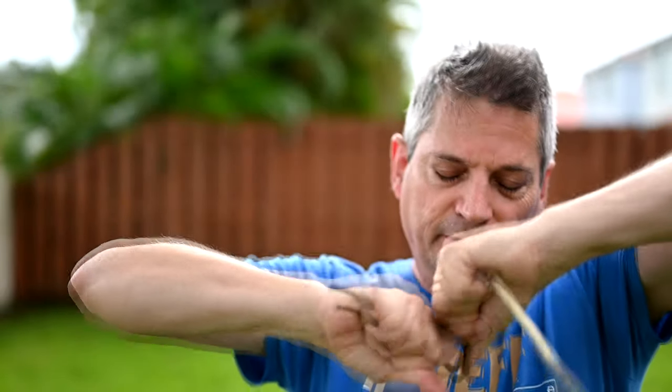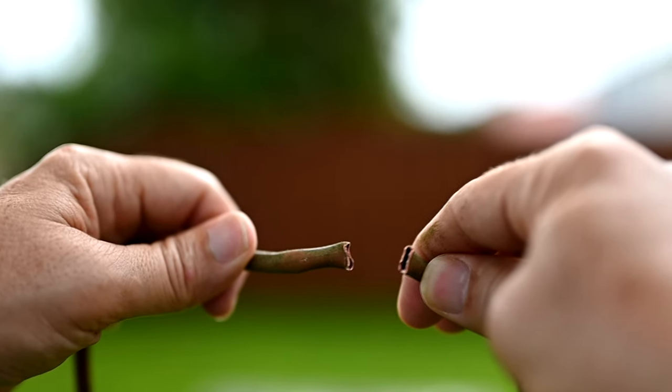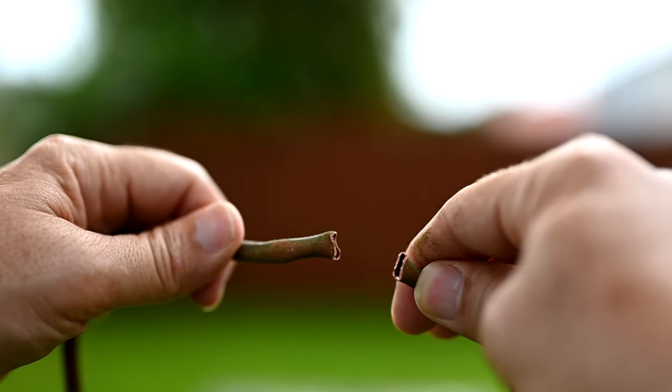I don't know if they just get more brittle with age, but watch this — just a couple of times bending and that's all it took. Three or four times back and forth — that's all it took to get the copper tubing to bend and break. You can see how it deforms and just shears it right in half. Remember, the two common remedies are: get a kit to fix the end, or simply take out the whole thing and bypass it with a steel-belted hose.